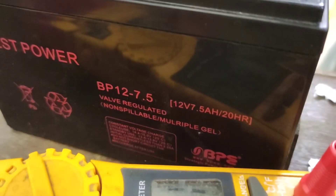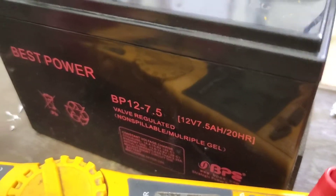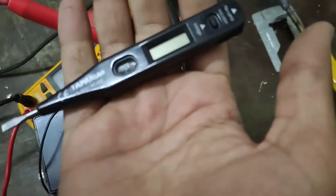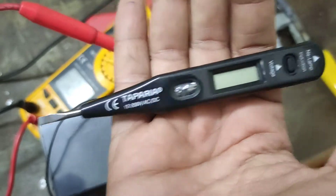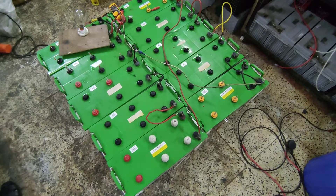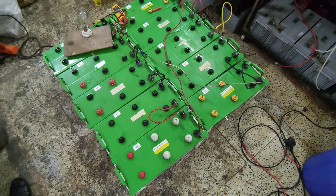So this is the battery I was using. We can almost certainly say that with just 12 volts this tester is not good at detecting DC. But we are not stopping here — we are going to test this setup with a 120-volt setup, since they claim this can measure up to 250 volts AC or DC.